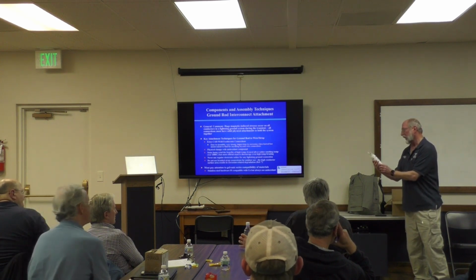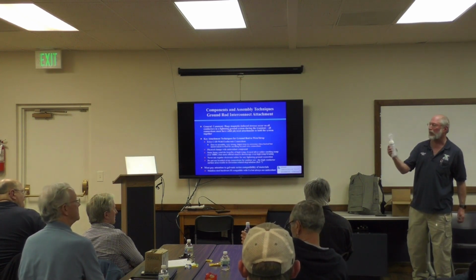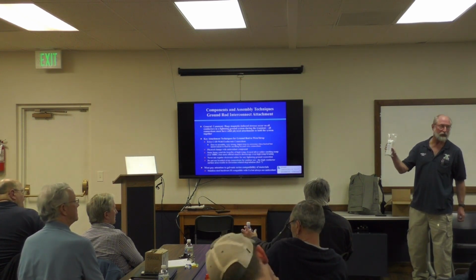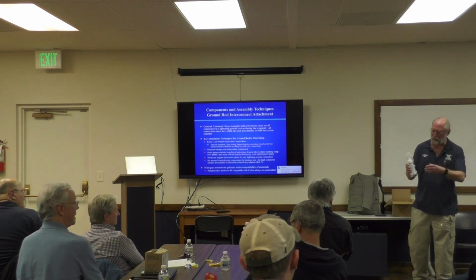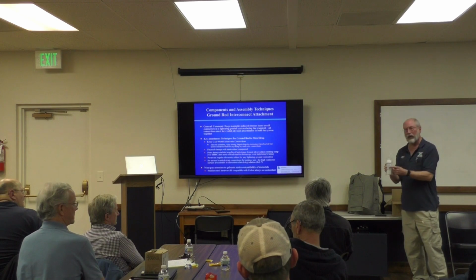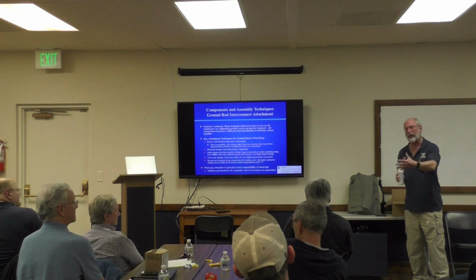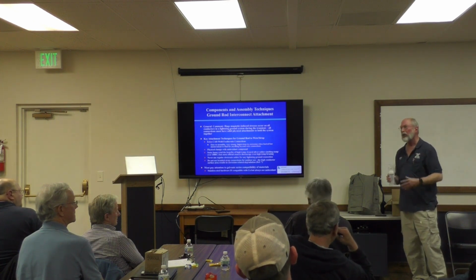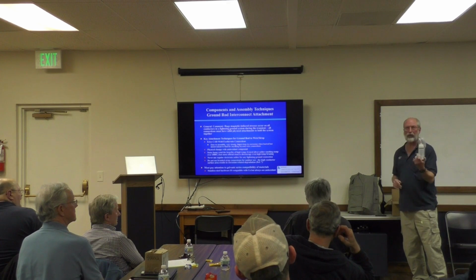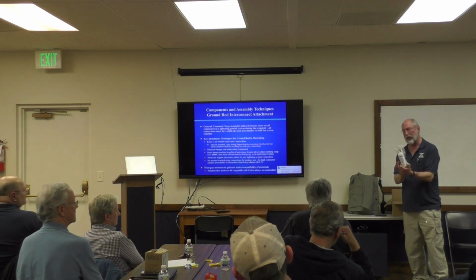And there's two types. There is the antioxidant for copper to copper, and copper to stainless steel. They have a similar, what's the word for that? The electropotential between dissimilar materials, I forget right now. Anyway, you can't just attach copper to anything because you'll get this reaction over time, particularly if there's moisture, and it'll corrode.